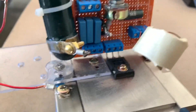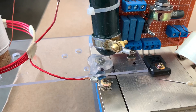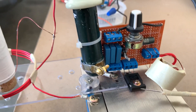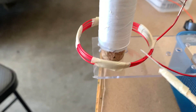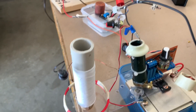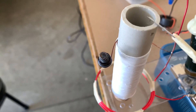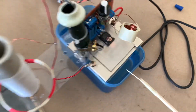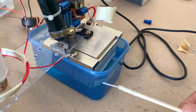Let me tell you a little bit about how this works. This is a Class E resonator, which is basically an electrical engineering term for an oscillator, and I'm going to post a link to that circuit in the description. You've got an L2 coil which is the primary coil, and here's your secondary coil — this is 135 turns of wire. You can't use PVC because it melts, so this is actually ceramic, in this case alumina.